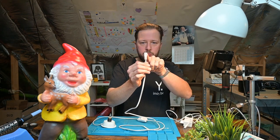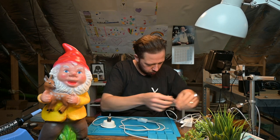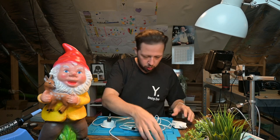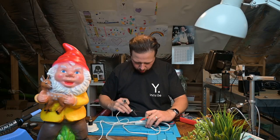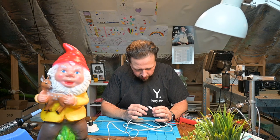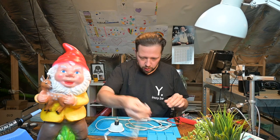So we've got two prongs here. This is a connector for a 12 volt power supply that I got out of an old switch. So what I'm going to try to do is just plug this in. Now we should have 12 volts between these two. Hold it against the prongs and at least see whether or not the device still works. We do have 12 volts going into this. When we make a connection — we've got a light! And this is 12 volts DC.